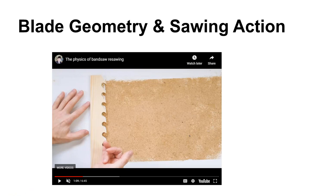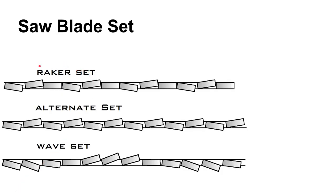If you have big teeth and a thin-walled material, the teeth will drop into the material and shear teeth off. I've had people on multiple occasions use the wrong saw blade and ruin saw blades because they're cutting something too thin for the blade doing the cutting. A good rule of thumb is to make sure you have three or four teeth engaged in the material at least.